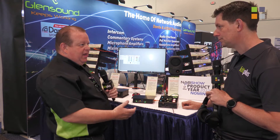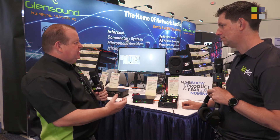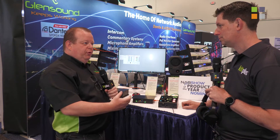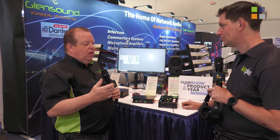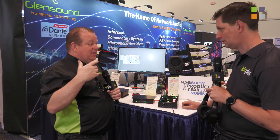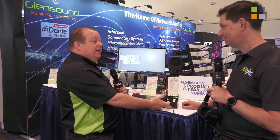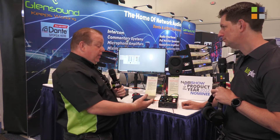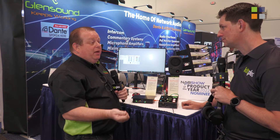Importantly, these are two separate headphone amplifiers that can be addressed independently. This allows the device to manage noise according to tournament rules — for example, sending noise to one amplifier and game audio to the other if an over-ear headset is required when out of game. It also means noise and game audio can both be sent to a single pair of headphones if the tournament rules allow.